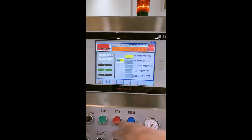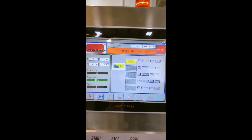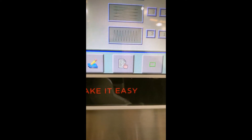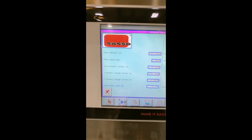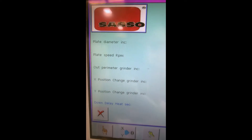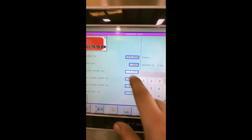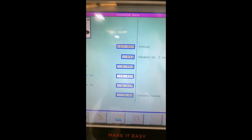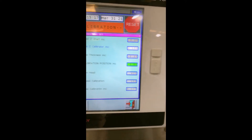Before you start milling the table, increase the overlap around the edges — otherwise you'll miss the corners and it won't be fully done. Come down here and hit the icon with the little finger and the paper. On the left you have 'out perimeter grinder' — that's what you're going to set. For milling the table, I would set it to about six inches. That'll give you six inches of overlap, so the head is going to be hanging off the table about six inches, and that's totally fine. Go ahead and start your program as long as you have your parameters all set.